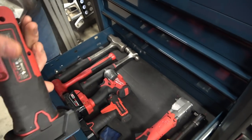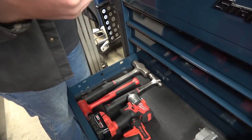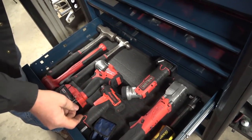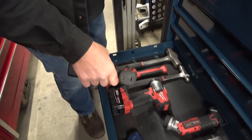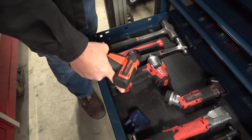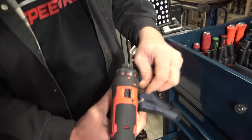I have another light like this and you can send these in and get a partial warranty from Snap-on — basically get a newer one for $45. I'll probably do that this year since the head's starting to go a little loose. Here's my 14.4 driver with a bit set. I use this as a drill a lot of times with a step drill bit because the step drill bits have a quarter-inch shank. When you're just punching holes, it's better than going to get the drill — it doesn't slip, it's consistent, and you can dial down the power or use gear reduction for a lower speed.